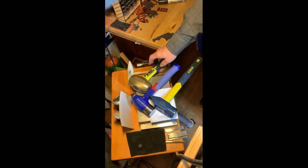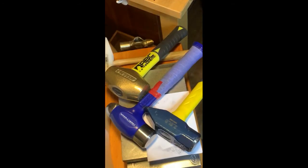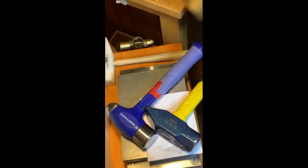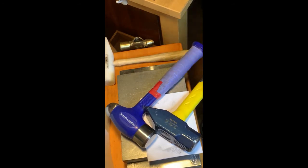So we're going to go down in order from things that I use, and I'm going to zoom in a little bit here. We've got a 4 pound brass hammer, which, at 60 years old, when I don't feel necessarily strong or I've got a larger substantial stamp, I will use when all else fails. I wouldn't, however, want to use this one on the smaller stamp. I could actually damage the stamp. And of course, whenever you're doing this, consider safety, wear safety glasses.